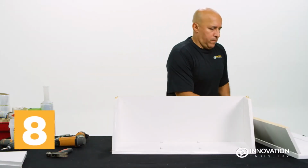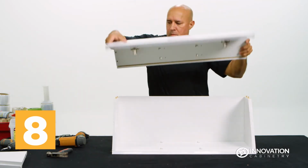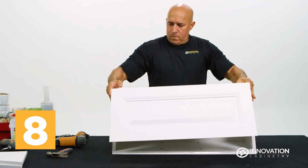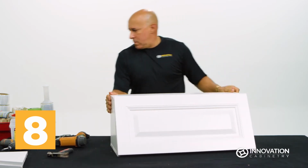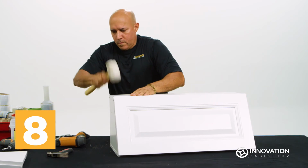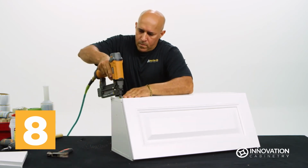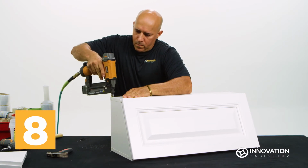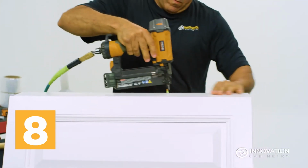Combine the previously constructed door and narrow side panel with the backing and wide side panel by placing the narrow side panel slot side down on top of the backing. The top and bottom pegs should slide into place on the narrow side panel, and the attached door should swing down flush with the rest of the assembled cabinet. Press into place and use a rubber mallet to gently tap where the 2 cabinet sections join.